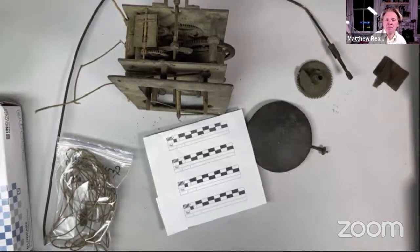I think the thing with taper pins, if they're not draw filed, the kind of thing I've seen where I think they've been original, of course we'll never know, is in French clocks, so relatively modern, late 19th century clocks. And in the Enfield, of course, we see pins in there that are probably maybe original, who knows. So I'm not particularly fussed about taper pins. I would say that's one area where you want the thing to be safe and functional, but you can definitely clean them and straighten them. They're usually soft iron, so that's easy to do.